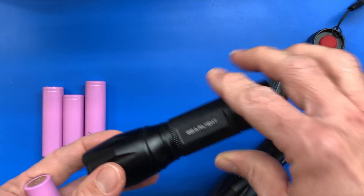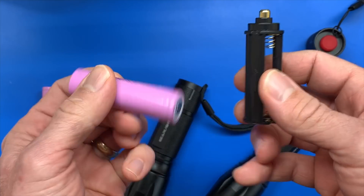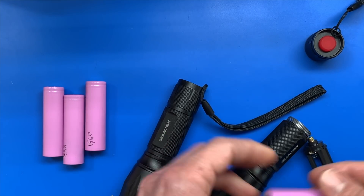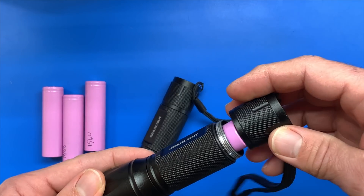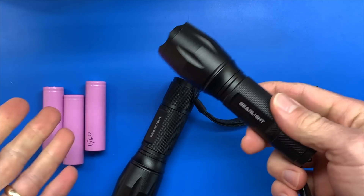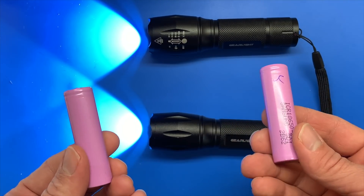These LED flashlights made by GearLite take 18650 batteries. They came with a holder for three AAA batteries and notice it's about the same size as an 18650 — which usually means you can replace it. You can drop in a new 18650, and they even give you a plastic holder to keep the battery from rolling around. These batteries are completely usable, hold a good amount of charge, and if not for YouTube I would have thrown that dead laptop battery away — possibly ending up in a landfill. Instead I now have four lithium-ion rechargeable batteries for my flashlights and future projects.